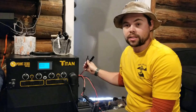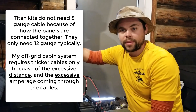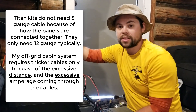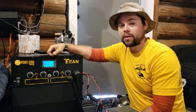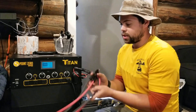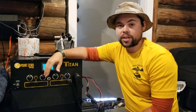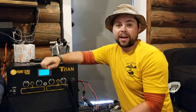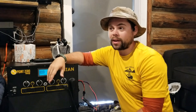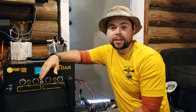This is slowly falling — that's just because above 29 volts it stops charging with a wall charger, but with solar panels it'll go a little bit higher, so we know it's working. I upgraded to this 8-gauge cable because the 12-gauge cable was doing a decent job, but then someone ran into our solar panels and after that it just wasn't enough power. Because I'm putting basically 2,000 watts into each set of cables, I wanted something much heavier and stronger for a 350-foot run. The last thing is to tuck away these big cords behind the Titan. The mount, with all the wind going on, was not moving an inch — we were up there jumping around on it and everything, not a problem at all. It should last 20 years at least with that treated lumber.